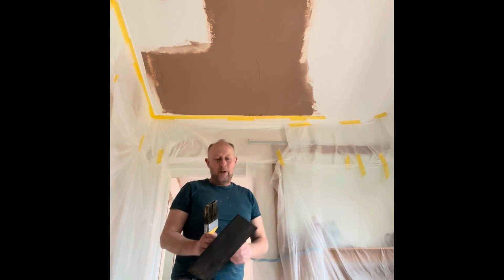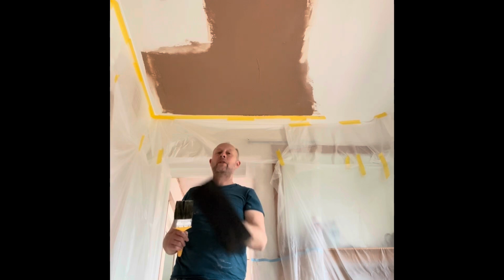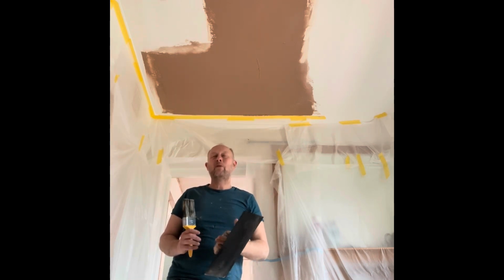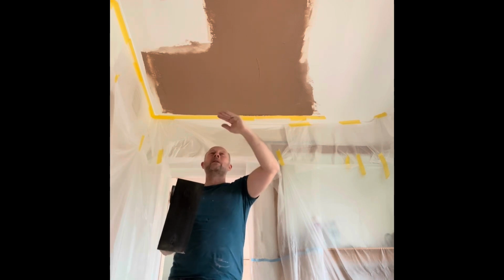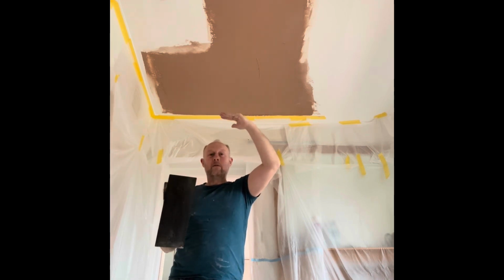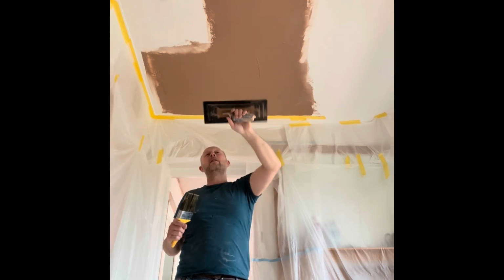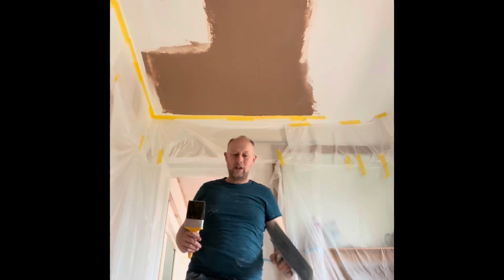And anyone that's noticed, I'm using a plastic trowel here because again there's a low joist there and it's a bit of a rocker, so I'm not going to lose that. So I don't really want a sharp trowel that's going to be trying to get flat when there's nothing flat there. So I'm using the plastic one, and you can blend the edges pretty well with these. They're quite versatile really.